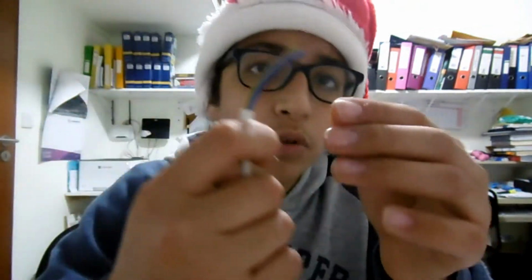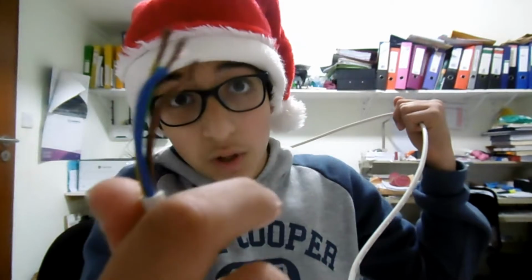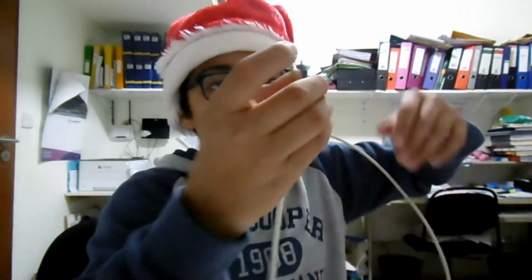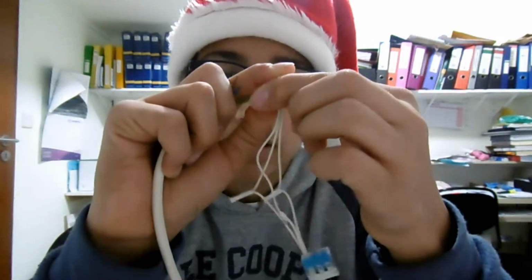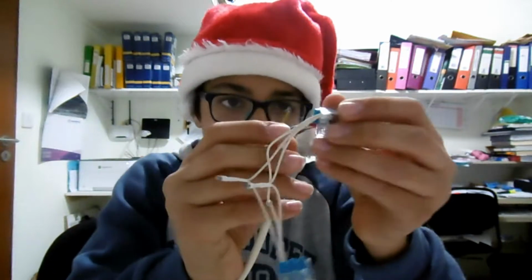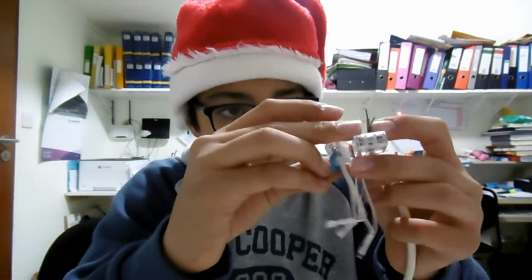Now, we get the wire that we want to make our power supply, which is this, in our case. We connect these 2 to the power lines, not the 230 volt, the 12-volt ones, because of the power supply adapter. And these 3 go in 1 Wago, like this. Open, shove 1 wire in, and close. And same for the other one.